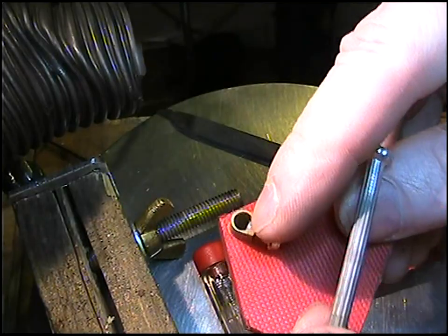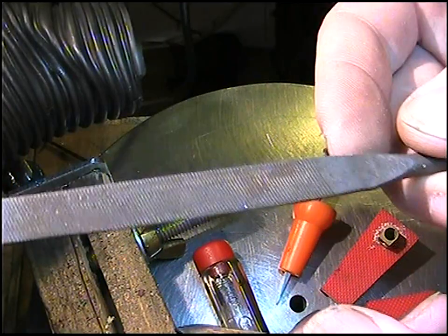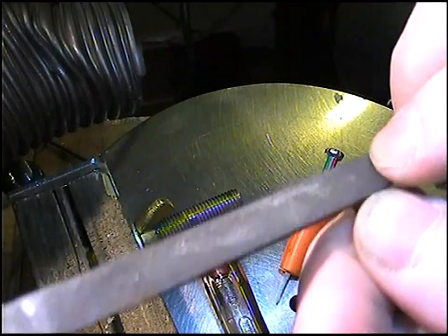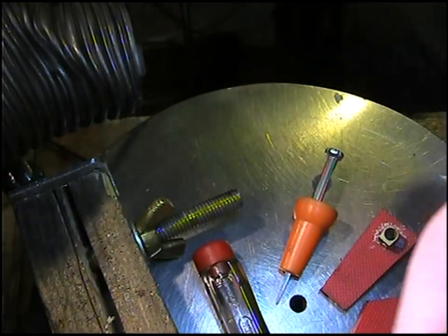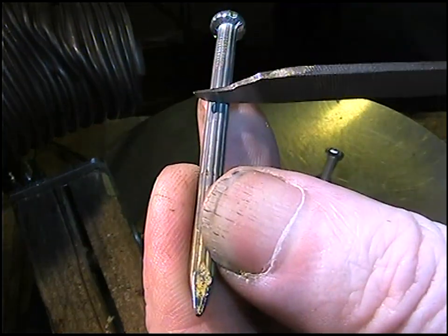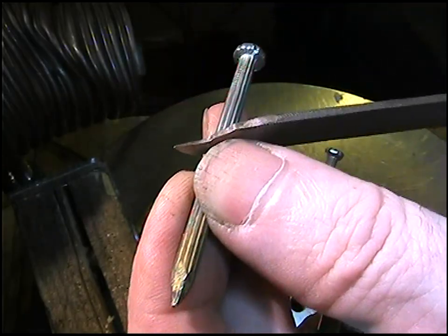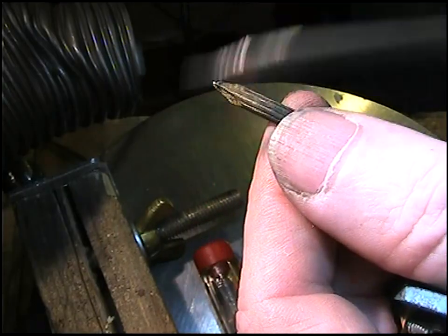These templates are designed to use something that's round, so any steel that is hard enough. If you get a metal file it just bites but it kind of slips off. Anything you can find — a drill bit or piano wire — you can buy piano wire in different dimensions. It comes soft; you can temper it if you like. Look on the internet to temper — I'd say the color is yellow according to what I read, so you could make something better than this.